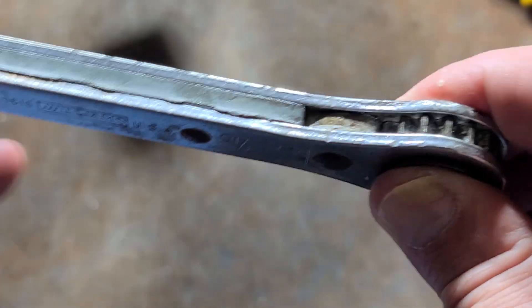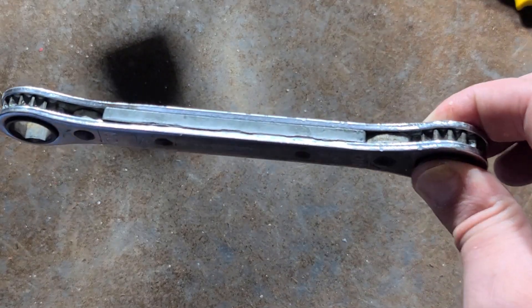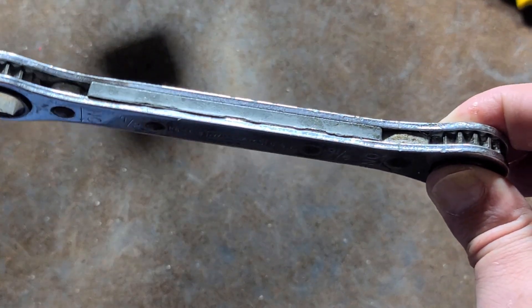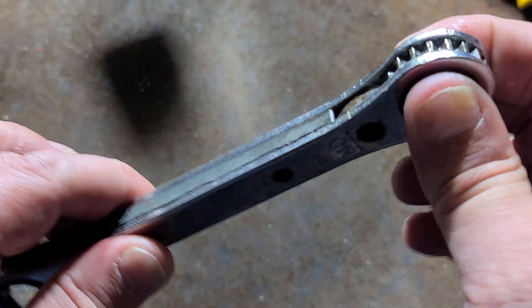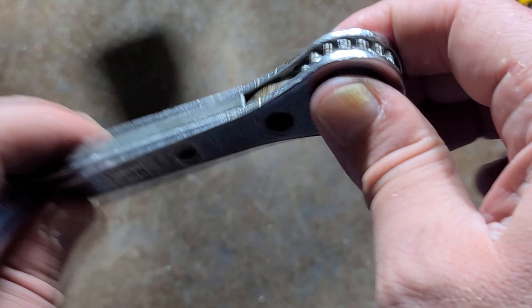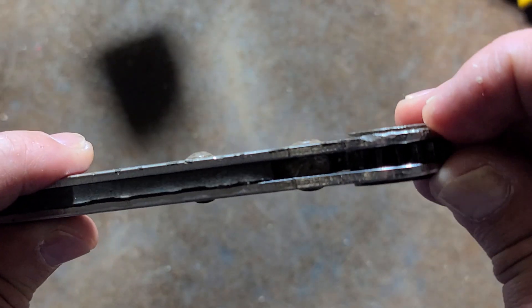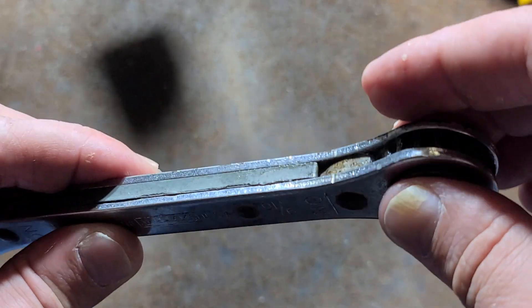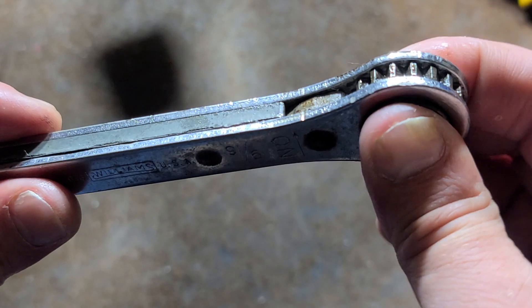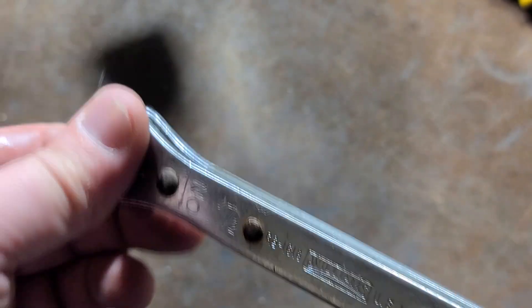What I mean by that is we can take this wrench and I can raise it up horizontally — freshly lubed — and it still won't ratchet. So as soon as you break the bolt loose it's just going to be rocking back and forth. The plates aren't crushed in; it actually runs pretty darn smoothly. It's just the fact that it has a really strong spring for the ratchet pawl.